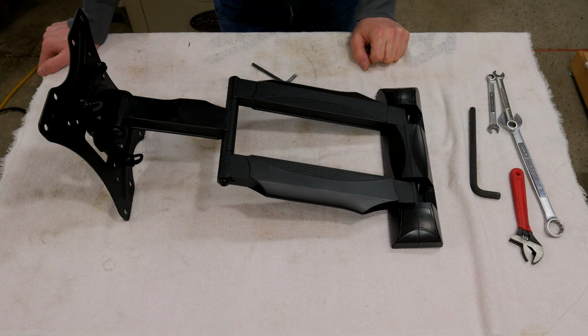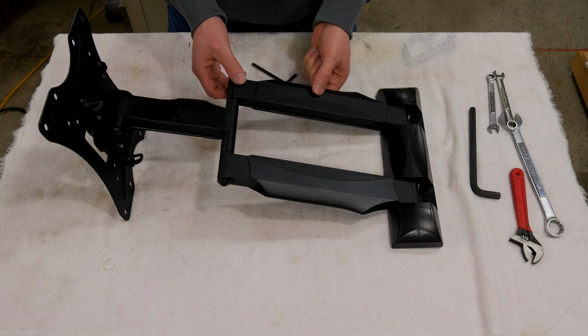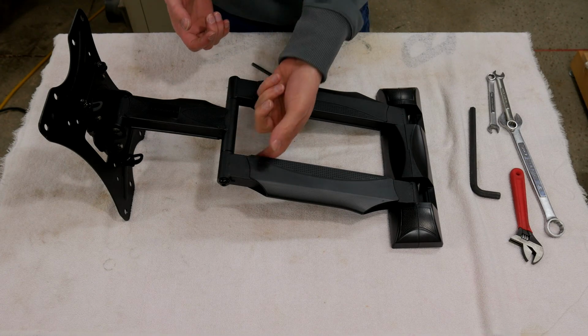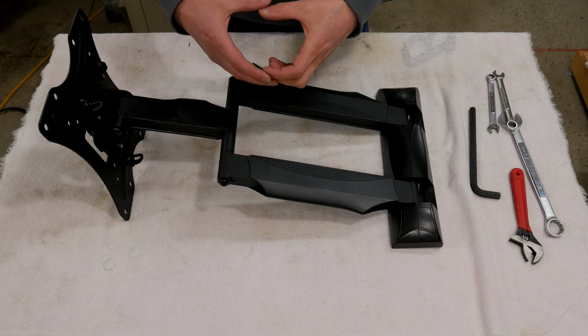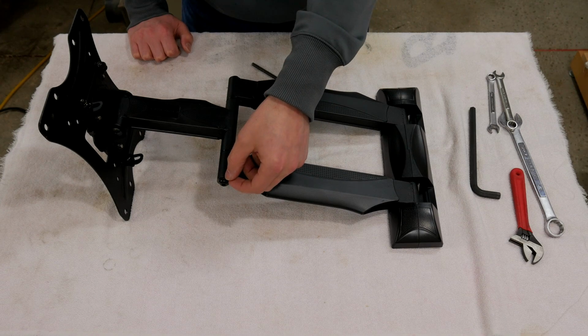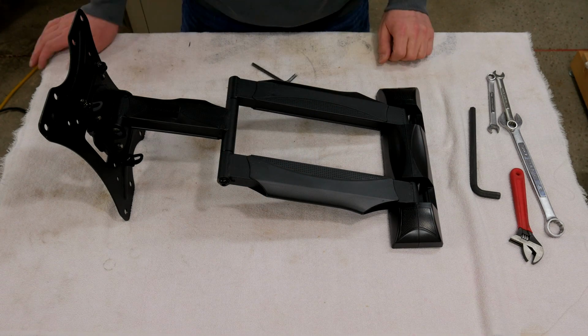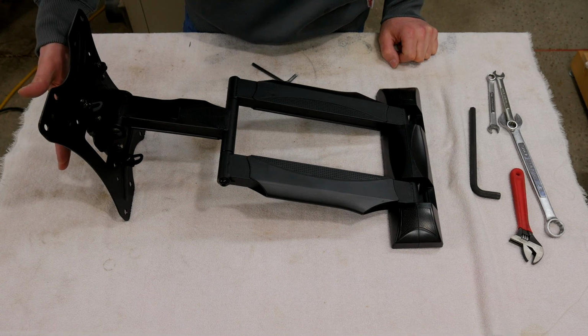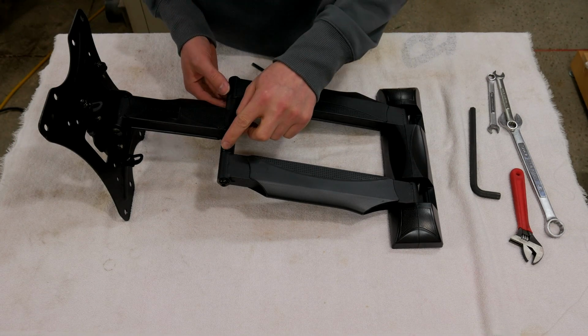and 1-inch diameter DOM tubing. And what I had done is, once I got them all welded together, to guarantee that my bore was nice and round again, because when you weld something like that, a piece of thin wall tubing, it's going to egg shape on you, I bored it out, and basically the tubing became 0.06 inch, roughly, in wall thickness. And after putting them together and playing with them, testing them, what I quickly noticed is if you put any amount of weight on the arms that far out, what would happen is on the top and bottom